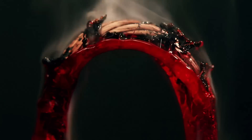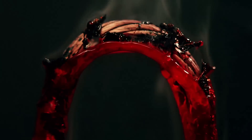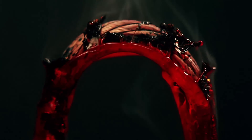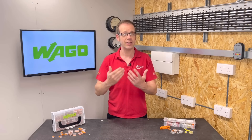Because the temperature of the conductor gets higher the more current flows, it follows that a cable with insulation that can cope with higher temperatures can carry more current. We can confirm this by comparing the current carrying capacity of cables that are the same size but have different insulation.